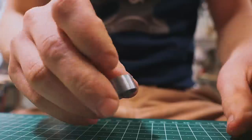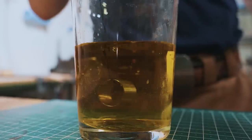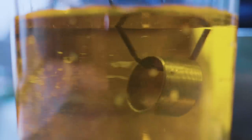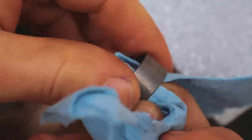I'm going to pop out the silver and do a test etch in some very mild ferric chloride to work out exactly where we want our stones before hardening it. The acid is already starting to etch into it — that's just as much as we need. We'll neutralize it in some bicarbonate of soda, give it a wash off under the tap, then dry it off and evaluate my options.